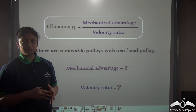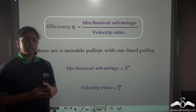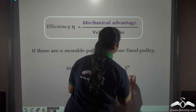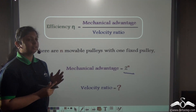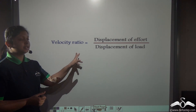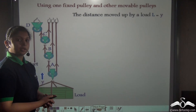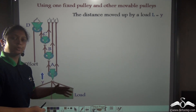To find how efficient this combination of pulleys is, we need to calculate the efficiency of this combination. Efficiency equals mechanical advantage divided by velocity ratio, and we have found the mechanical advantage to be 2 to the power n. Now to find the velocity ratio, we know it is the ratio of the displacement of effort to the displacement of load. So we need to find how far the effort moves in order to move the load.